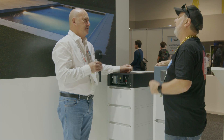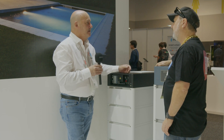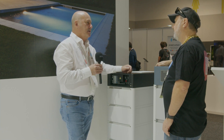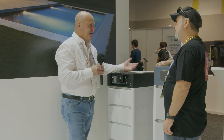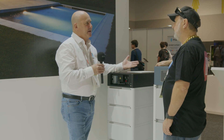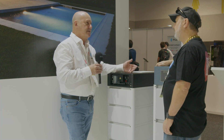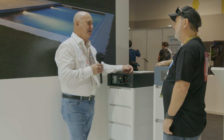Pylontech will always be doing the rack-mounted units and won't move away from those — they're the traditional product. We're doing a lot more commercial work now too, Glenn. The rack-mounted off-grid systems use an enclosure with a small number of batteries, and the Victron guys especially like to string them up in strings of four through a bus bar for control and scalability. We've also got new batteries coming in: the US3000C, a big improvement on the US3000, and the UP5000, which is a massive five kilowatt hour battery in a small rack — an absolutely amazing battery.